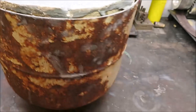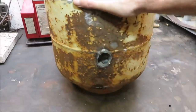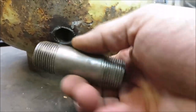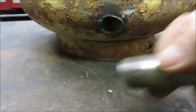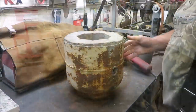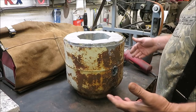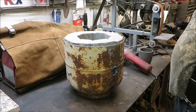What I'm going to do now is get to cleaning the outside of this thing up, and then we're going to be welding on our drain down here. We're going to use this as a drain — we're going to be welding on a piece of three quarter inch pipe. I'm going to cut this pipe in half and stick it up on there and weld it on so we have a drain for this thing in case something happens to that crucible. Then we're going to get the outside cleaned up and painted. I'm going to go ahead and get the wire brushing done because it does look awful — it's got a lot of flaking rust and paint on it.